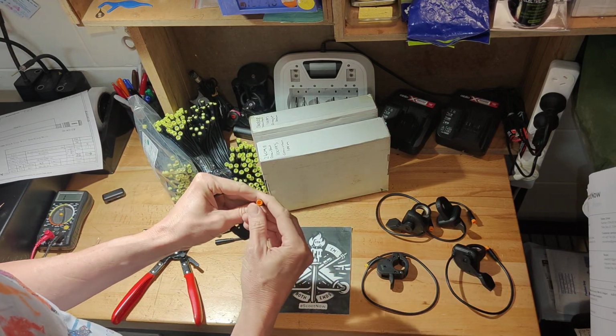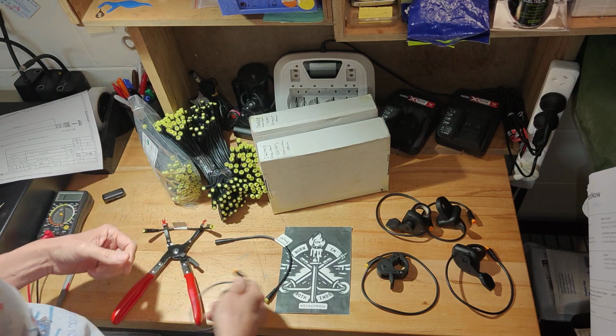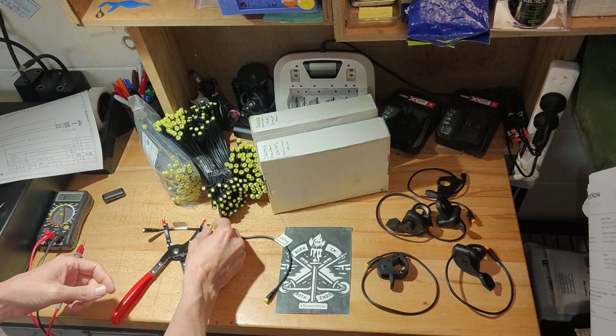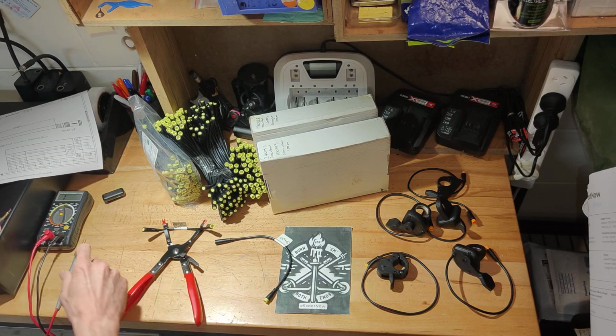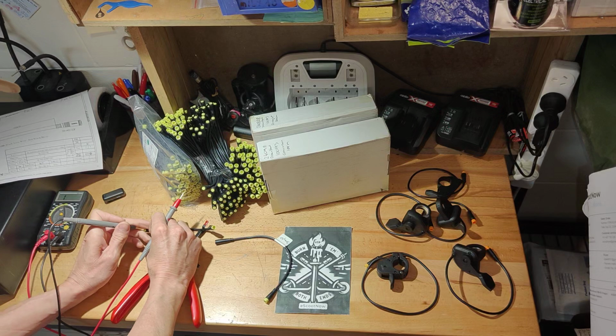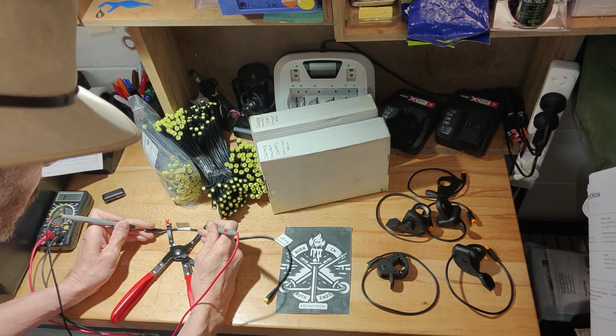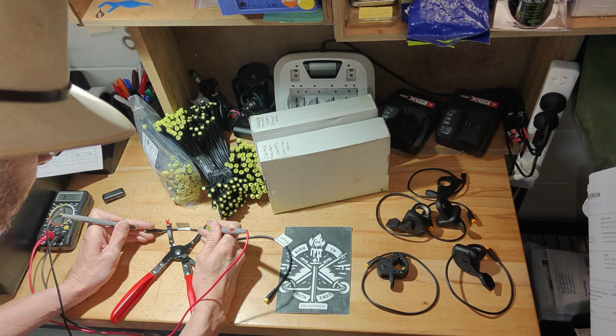They've all got that sort of plug on them, male. So it goes into the female one here, and then that end goes into your wiring harness, the main line down the stem. And just, for the avoidance of doubt, if I was to check the continuity of the negative line, which we know is the one that's away from the notch, it's making connectivity.